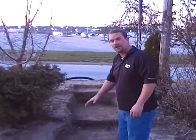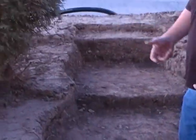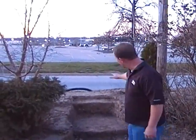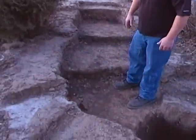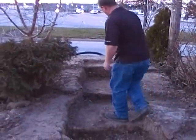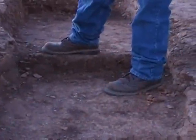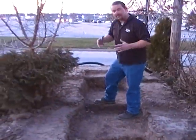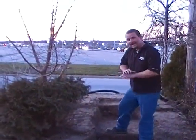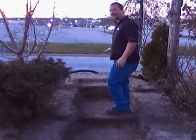You're going to be able to hide all this with stone, and you'll see that in a later video. If you look, we've got several — I call them stair steps. Wherever you want falling water or a waterfall, a sheet type waterfall, whether it be that or water cascading down rocks, you more or less want that stair step. You can see we've got three of them in here. This last one may not be much of a fall because of how our grade's ending up. This particular one isn't very tall, so we don't have to worry about splash. Wherever you have a sheet waterfall, the taller it gets, the more you have to worry about splash because that water falls, hits gravel, and goes all over the place instead of back down where it needs to be. When they're short like this, you don't have to worry about that.